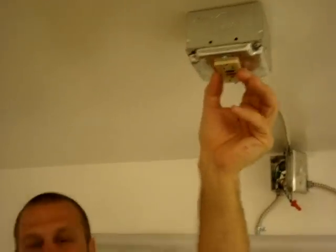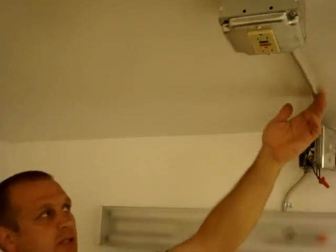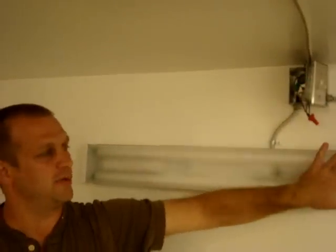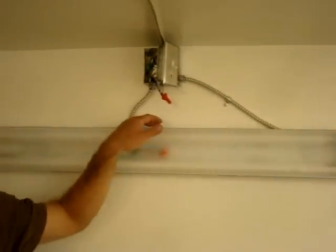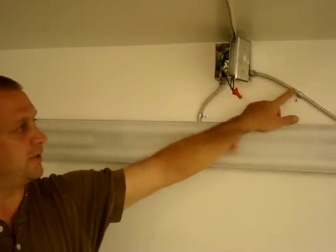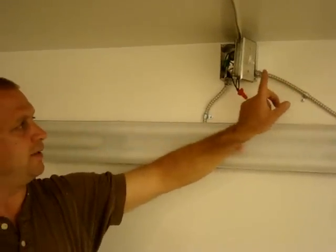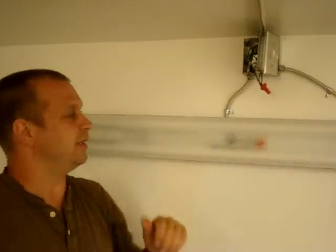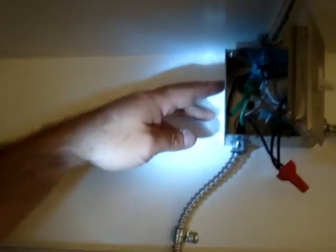What I've done here is, coming out of this junction box, there's a GFCI outlet, and it also happens to feed the circuit over to this switch, which turns on these two lights. The armored cable is all secured within 12 inches of the box — that's another mistake that I sometimes see. And the box is properly grounded. Come on in and let me show you how this box is properly grounded.